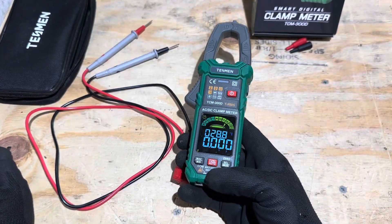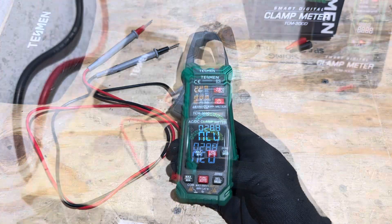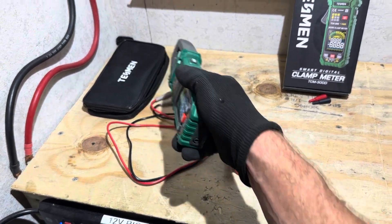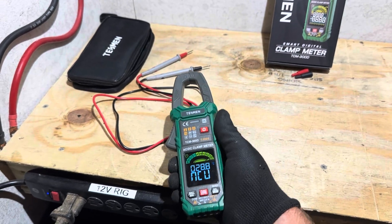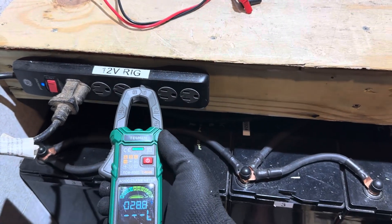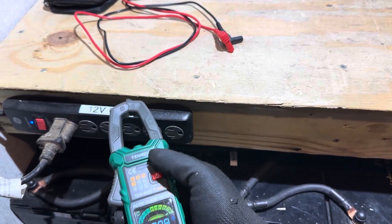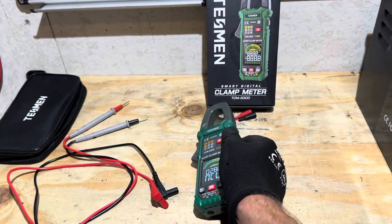We'll do the non-contact voltage setting. Scrolling through to non-contact voltage — the sensor for that is in the little bump-out on the clamp. As for helping identify live wires, please don't trust non-contact for putting your hands on something. This is to help trace out a live wire in a conduit or junction box, isolating circuits, helping determine the live wire — not for safety to confirm a circuit is dead. This is not the most sensitive non-contact voltage on a cheap meter. You have to get right on a breaker, right at the source, to get the indicator to turn red. But you can trace down wires to help you out for whatever you need that function for.